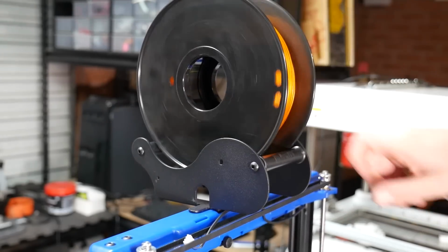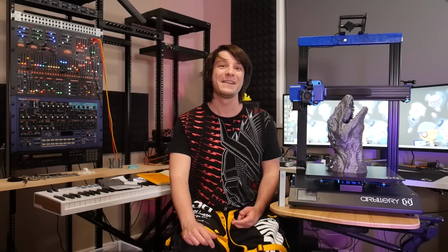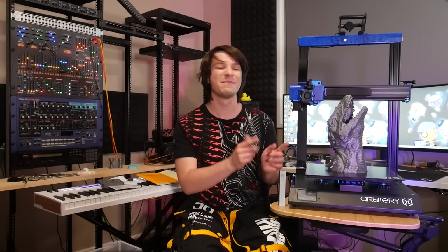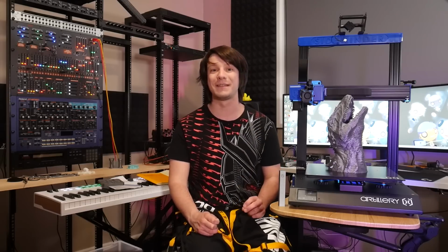I'm not a fan of the print bed being permanently fixed or the awkward filament holder, but they do work, and the Ultra Base style glass is pretty durable. I don't see I'm going to ever have to replace that, pretty much. But personally, I'm going to equip this printer with an external spool holder and PTFE tube to the hot end, so I can run like 3 kilogram spools with a 0.8mm nozzle for some truly large models in my future projects.